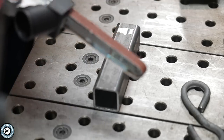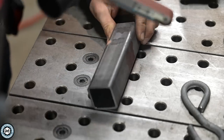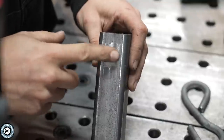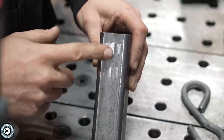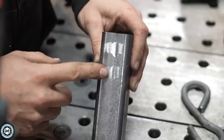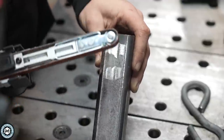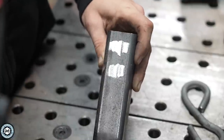This very inexpensive WEN band file just has a metal ball bearing on the end as the idler and contact wheel, and it has spring-loaded platens, which I don't really love. I literally bought this for the video just to explain every option out there. With a rubber wheel you get a much nicer grind. With the metal wheel as the contact wheel, the heavy grind marks wind up being a lot deeper and harder to get out. So try to get one that has a rubber wheel on the end.